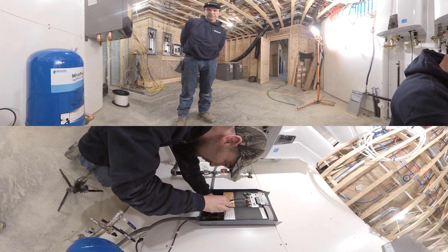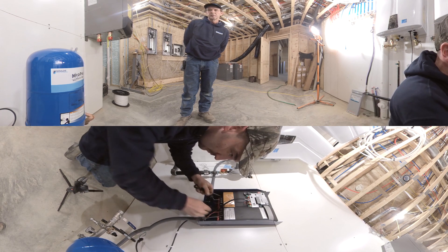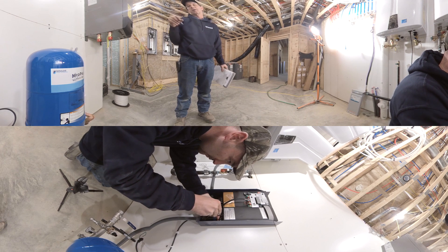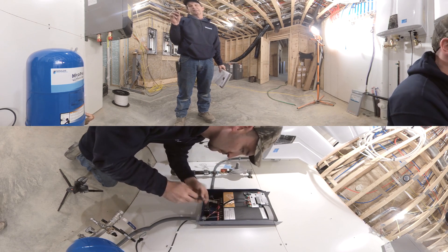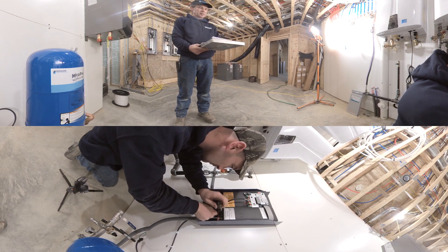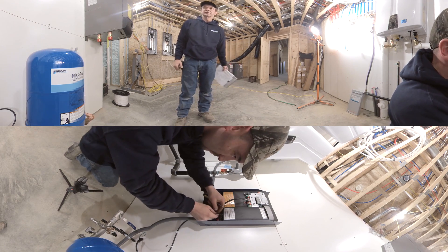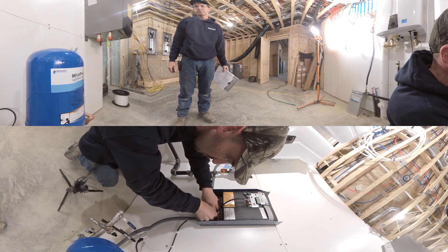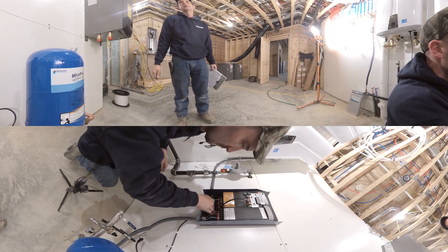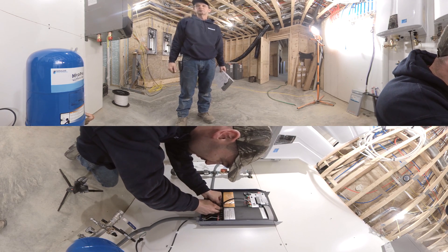While Tyler's making up the last few wires on the drive, let's talk about the set point. Since we have a 2 horsepower, 230-volt, 3-phase motor in the well, we have to set and check our maximum service factor amps. The maximum service factor amps on this pump is 7.6. Going into our catalog, you'll see that on the 3AS controller that requires a setting point for our overload at number 9. Once this is all wired and prior to the owner obtaining a CO, the electrical and plumbing system will be inspected by the electrical underwriters and local building and codes enforcement.